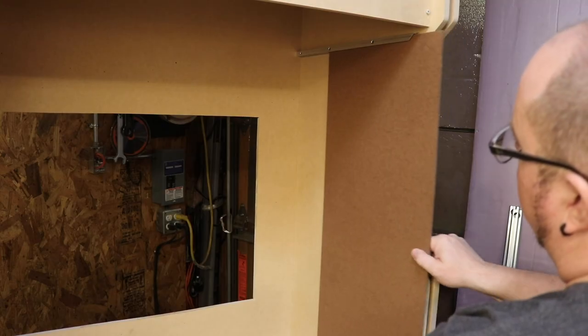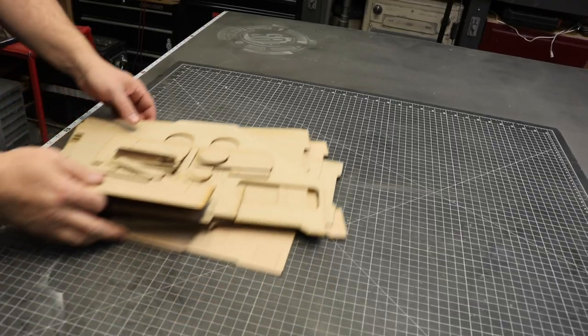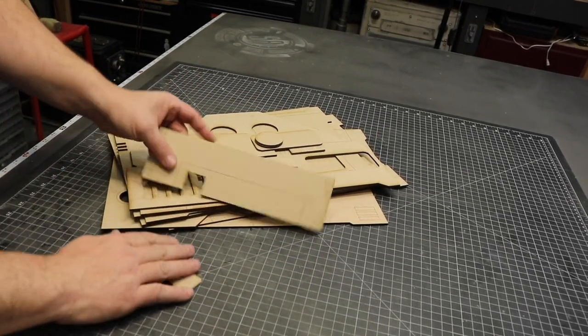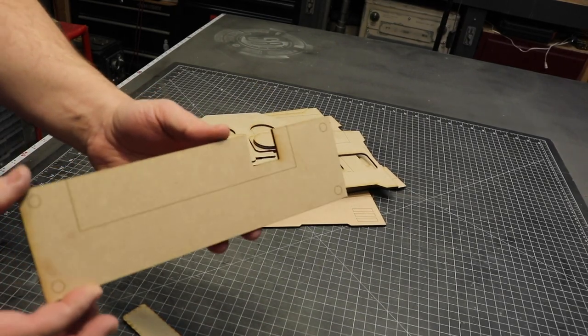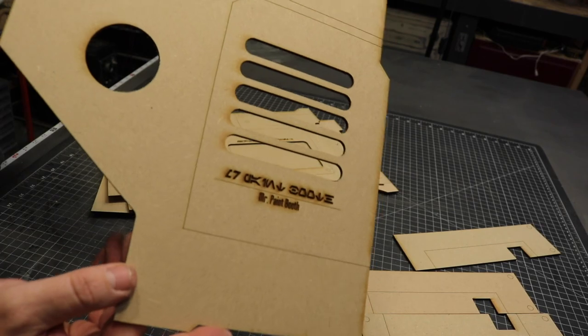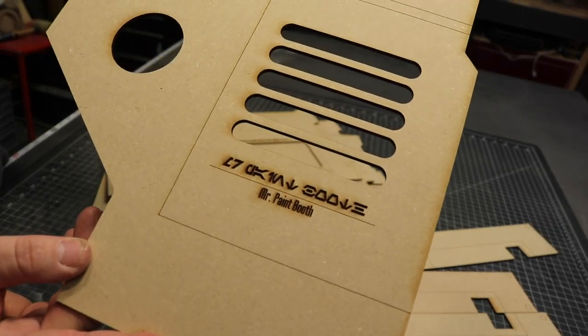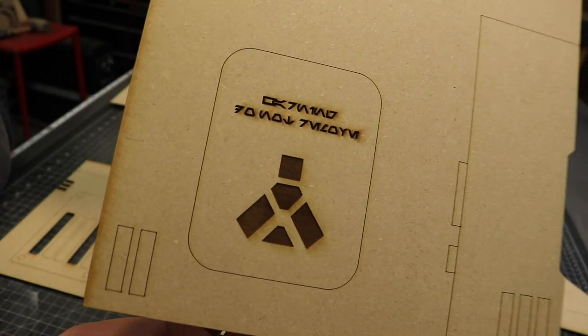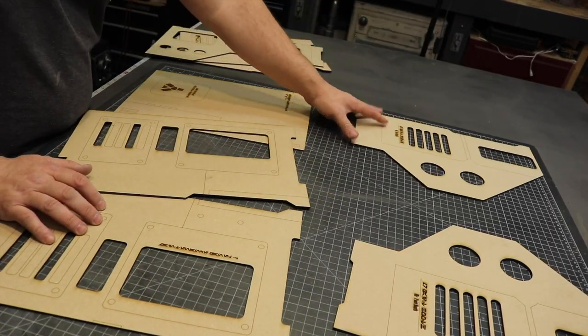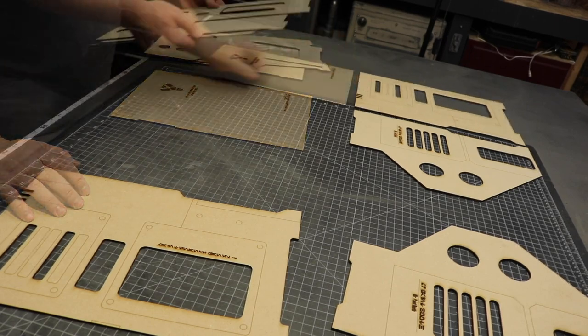For all the detailed panels on the outside of the booth, I did use my laser cutter. That said, I'm hoping the use of the other tools earlier in the episode gives you some ideas on how you could create shapes and designs without a laser. The patterns, for example, that we did for these could be cut out with a jigsaw. You could print a one-to-one template from your printer, glue it down to your material, and then cut it out.